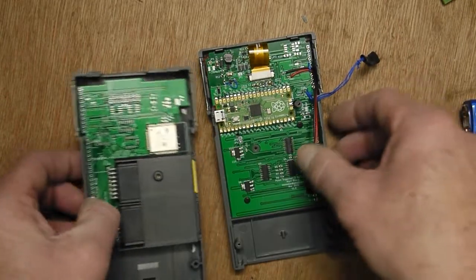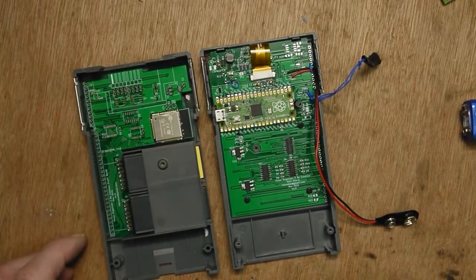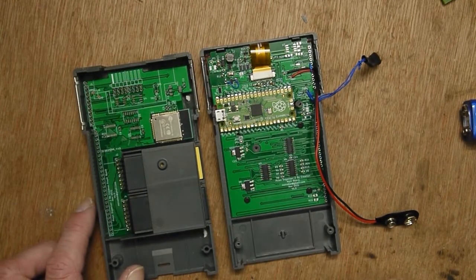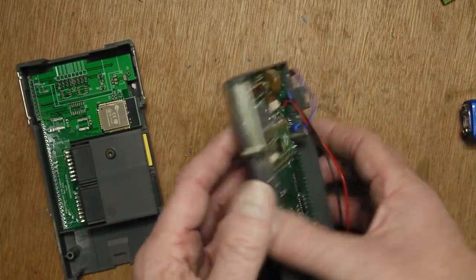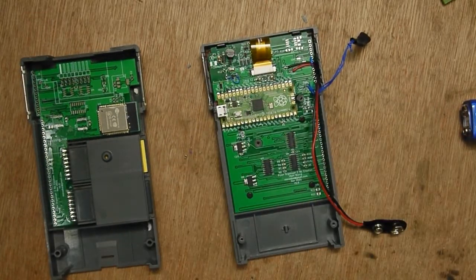The connection between the 2 boards should be alright as well. It looks physically to be closer than the original Organiser, and I did manage to retrofit that to the original even though they're staggered a bit, so that should be okay as well. So it's really just a matter of finding out why the I2C to the display isn't particularly reliable. We're not getting the demo code all the time, but everything looks okay-ish at the moment.